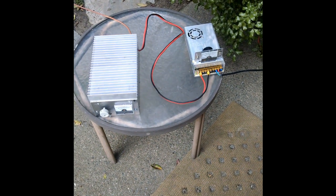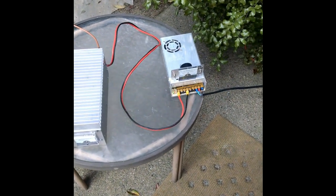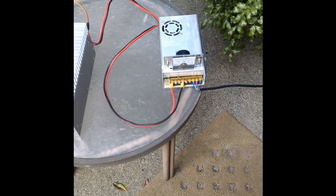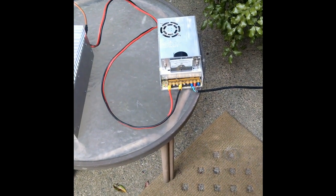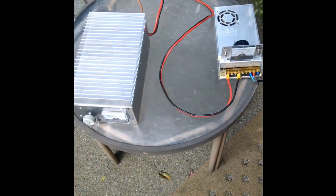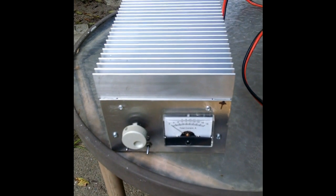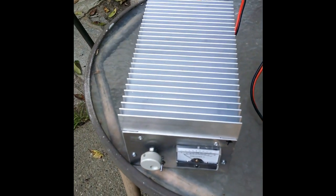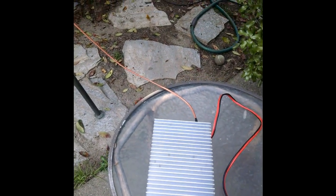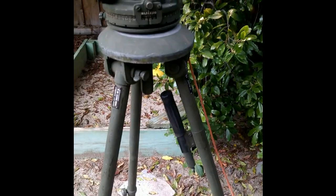Here's the surface wave transmission line demo layout. It's a 12 volt power supply set to about 13 volts at 30 amps maximum. It's powering a Toshiba 80 watt brick, which is driving through a short piece of coax — probably half a dB of loss, no more.